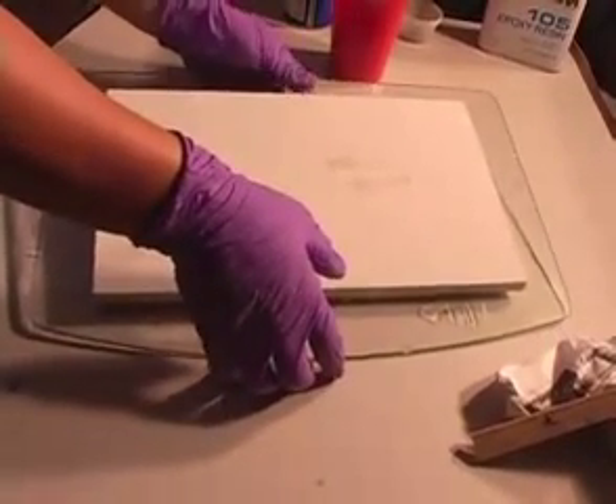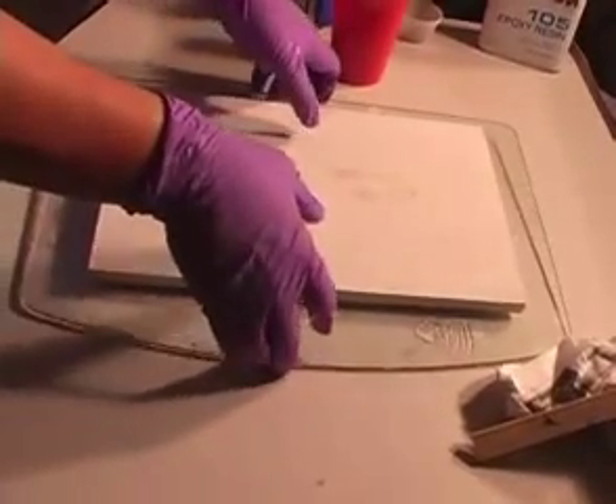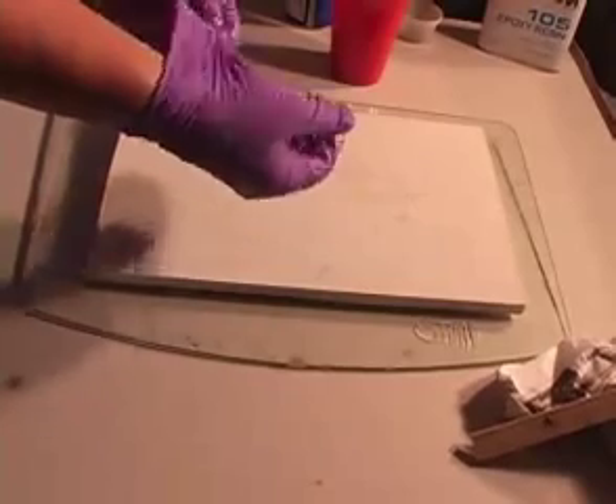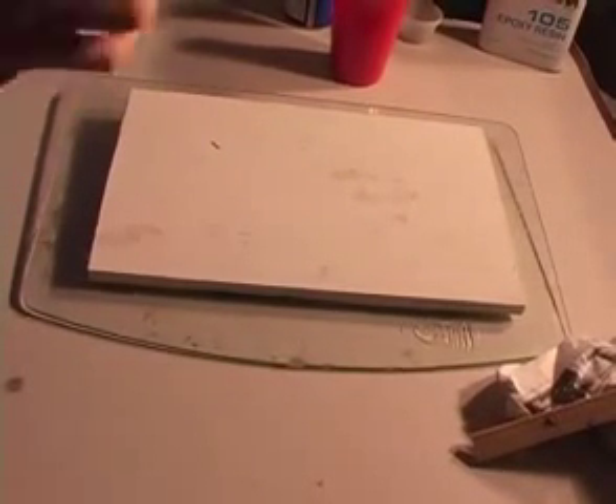Now apply a large block of wood or another piece of glass to the top of the laminate. This will ensure that in the curing process the mat stays in a uniform pattern, as well as aid in the removal of excess resin. Depending on the resin system you are using and the curing process you opted for, you will now need to wait anywhere from 15 minutes to 12 hours.